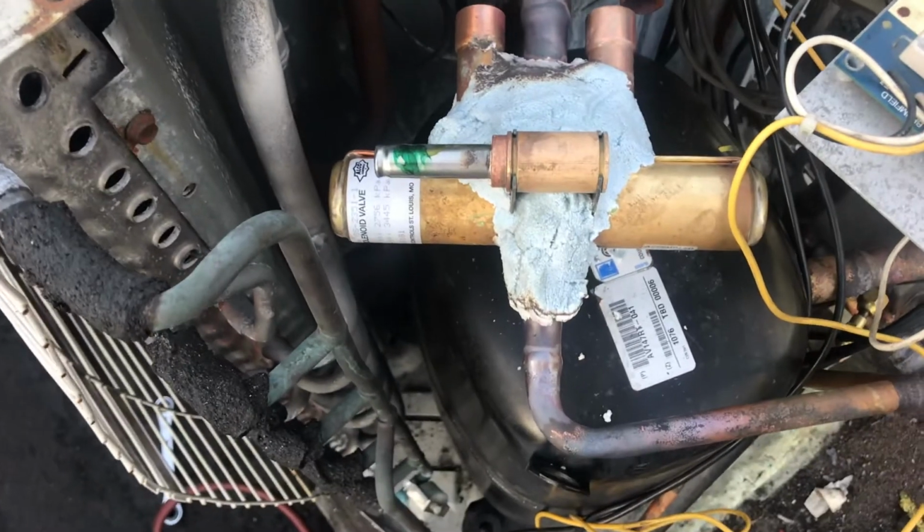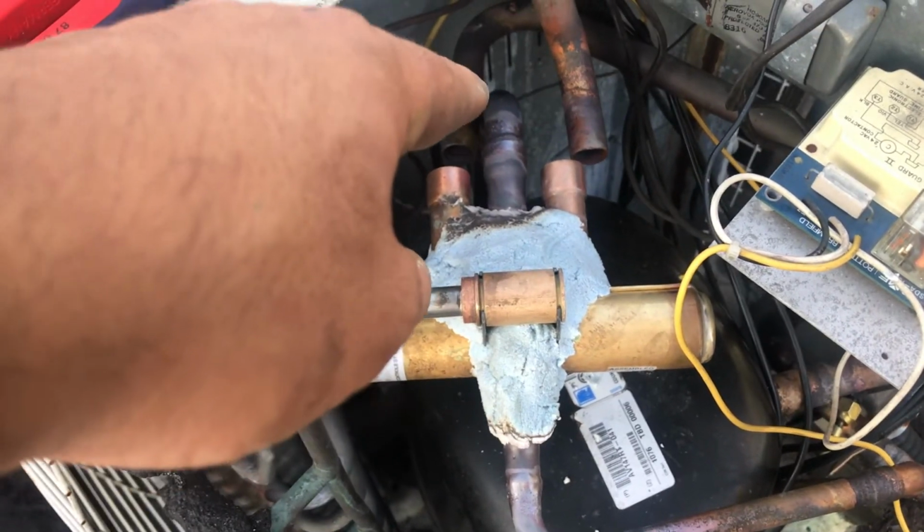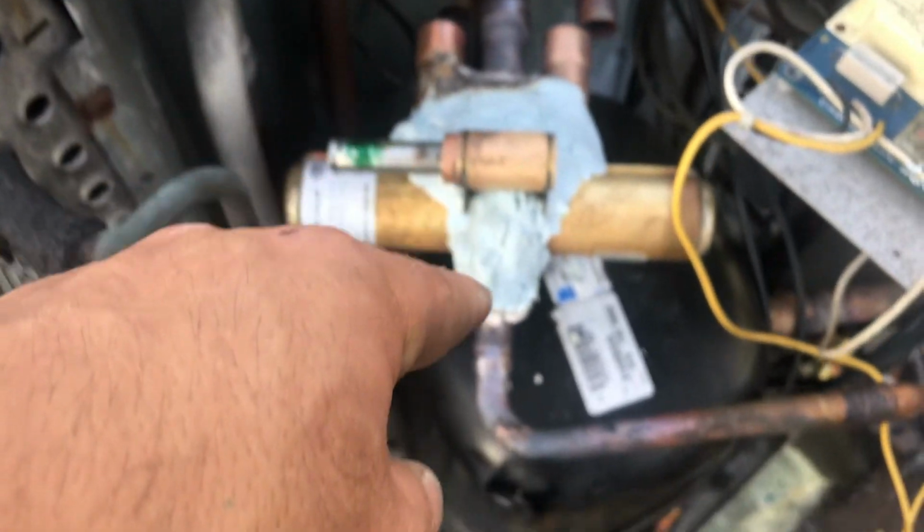In case you notice, sorry about that, my phone dropped. But I like to start with the middle one first, and then I go on to the sides. Everything becomes way more steady when you braze the middle one in first. Okay guys, I finished the middle one on that end,